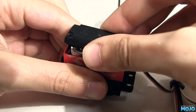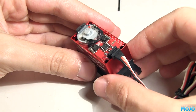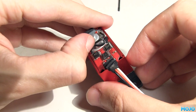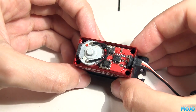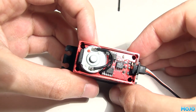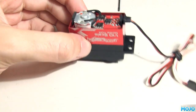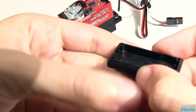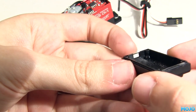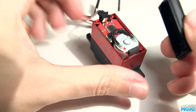On the underside is all the electronics. Looks very neat. The aluminium is indeed machined to fit around the motor — lovely stuff. Unfortunately, the PCB is soldered to the feedback pot directly, so without desoldering it's not going to come out. But we can see a pair of MT4607 MOSFETs and another 8-pin chip I can't find any info on. It could well be the controller, but the vias suggest there's some more goodies on the other side. From what I can see on this side, there's been some thought on the layout, so I'm happy with it. And if we have a look at the bottom cover, there's an O-ring — that'll help with keeping the water out from the electronics. I still wouldn't submerge it though, but the odd splash from puddles will probably be OK.